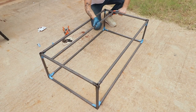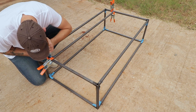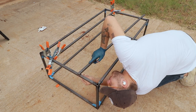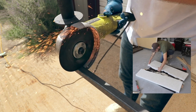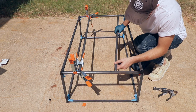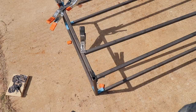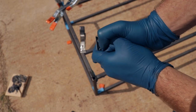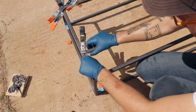I'm adding some supports towards the middle of the base so the concrete has a little more support. On one side the concrete cracked relatively straight, so I applied a straight piece of steel across the base. The other support piece needed to be cut at an angle because of an extra piece of concrete that fell off. I made sure the concrete overhangs each of these supports by a couple of inches so the support bar isn't visible from underneath. To make the brackets work at this angle, I was able to squeeze them closed or pull them open to match the right angle.